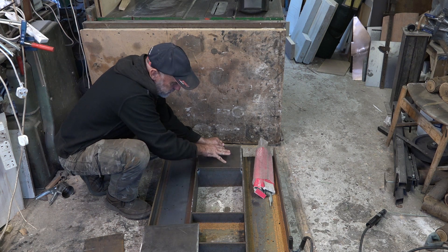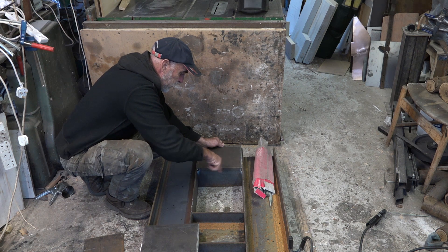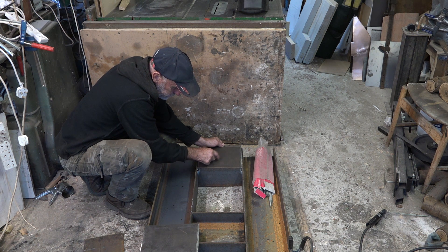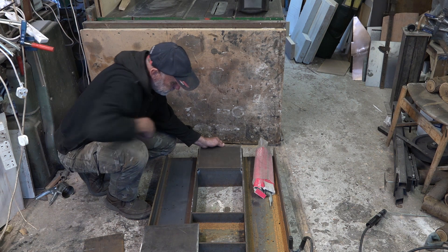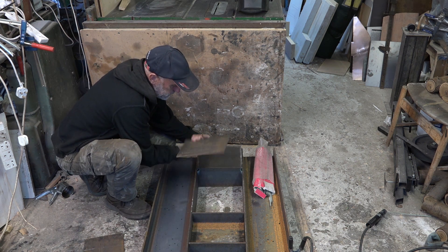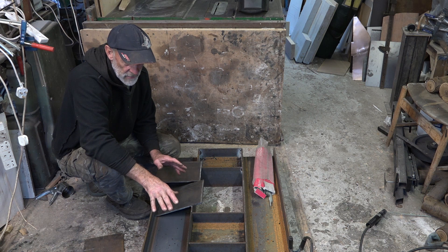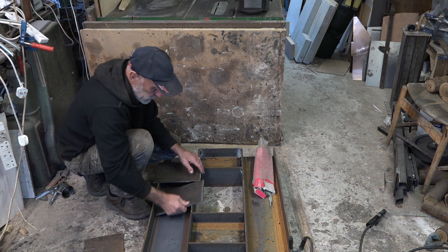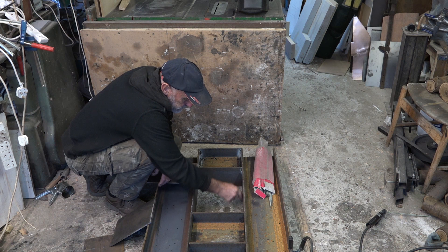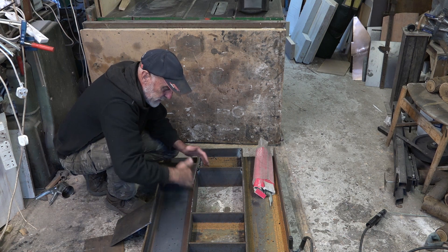I'm going to run a weld round. This is the top of the actual press and I'll need a little locking collar — a swinging lock collar. So I'll put another piece on the front of there which I can then drill a hole and tap it to take a bolt to hold that little locking collar in place. I'll cut two of them — there's one for each side. I'm going to weld them in. Then when that is welded up I'm going to clean these faces up, get that bit of mill scale off, run a file across and get it as flat and smooth as I can, ready for this operation. That'll all be greased up.